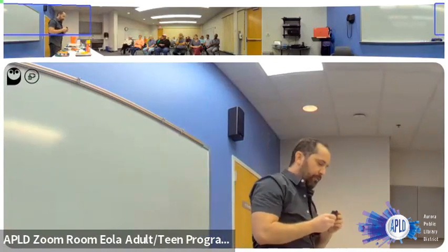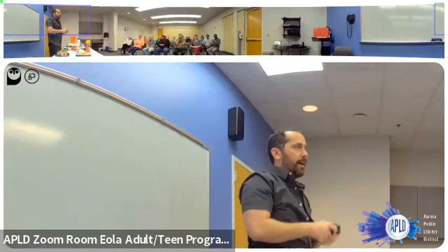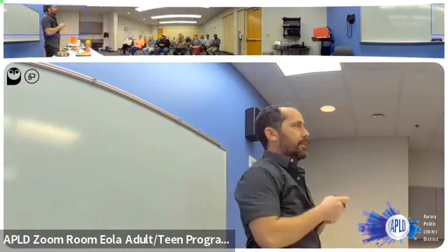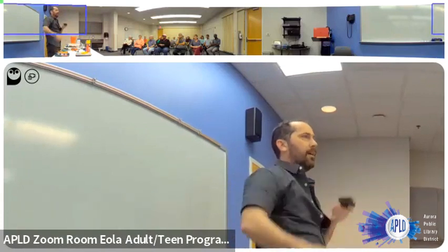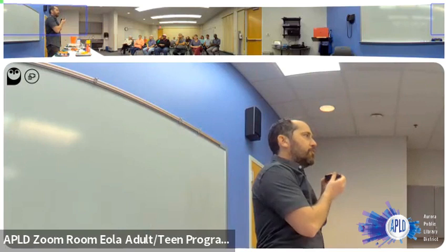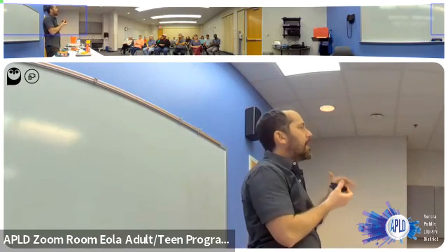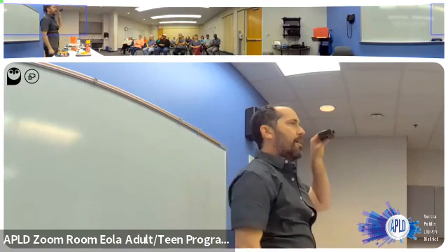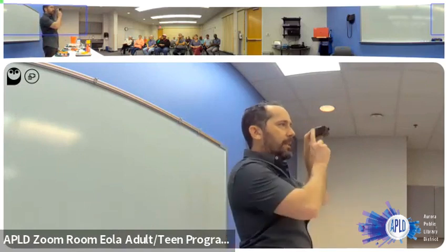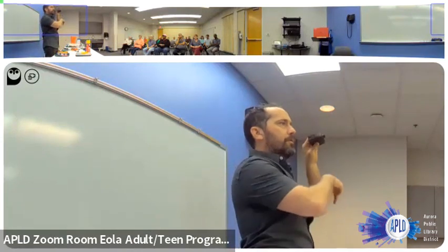The little thing I found out a lot of people don't realize, because it doesn't happen a whole lot, is if a circuit breaker trips, right? Like my toaster shorts out, and this bump goes like that, right? And now I can't power. And I go down to my basement and I find this and I say, oh. Most brands, when they trip, don't trip all the way to off. They trip in the middle, okay? And it can be a little hard to spot, especially if you're in a dark basement. Particularly old breakers that haven't tripped in a long time will often actually sit right there. It tripped electrically, but the little switch didn't move. But as soon as you touch it, even lightly, it moves, okay?